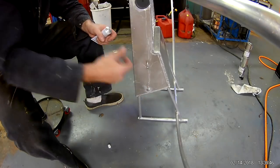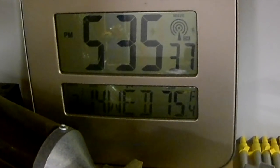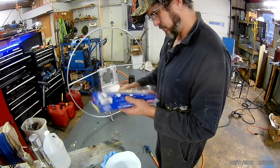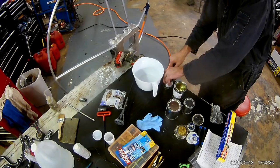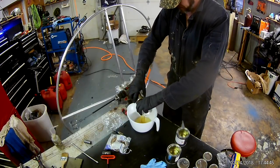I used a little dab of silicone to seal up the fuel sight gauge so it didn't leak chemicals. The epoxy also has to be just right on temperature — if it's too hot or too cold it doesn't work right. So I made sure I had optimal temperature in the environment and that it was stable for 24 hours before I did this.